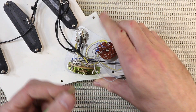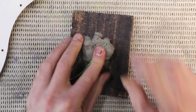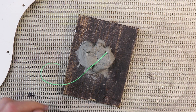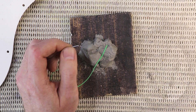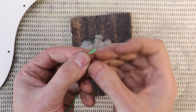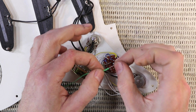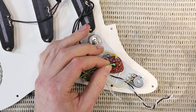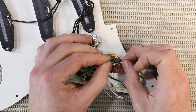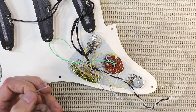With this skinny wire, what I usually do is actually tin the wire as I'm using it. It's not strictly necessary — you'll still get a good solder joint without doing that — but I do it for a couple of reasons. Firstly, the insulation on this wire will often actually shrink back slightly the first time you heat it, so by tinning it you're kind of pre-shrinking that little part of the insulation. The other reason is that it helps you thread the wire through these little eyelets. And thirdly, it means I can bend the wire over and it'll actually hold its shape, making it a lot easier to solder because the wire will just stay on the eyelet.